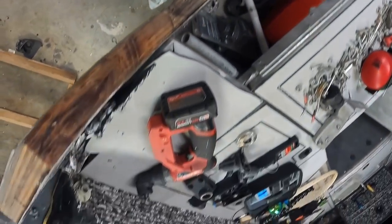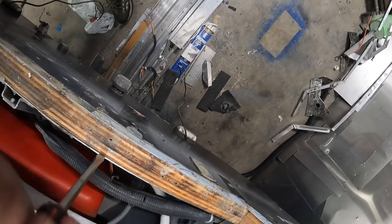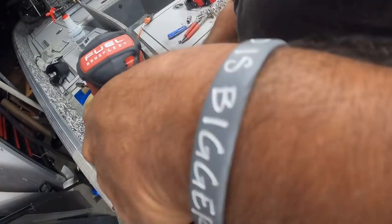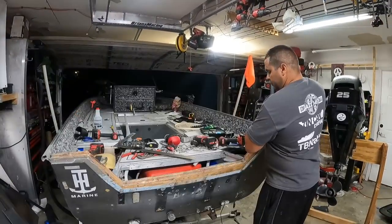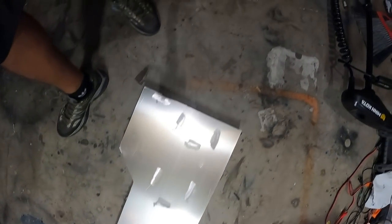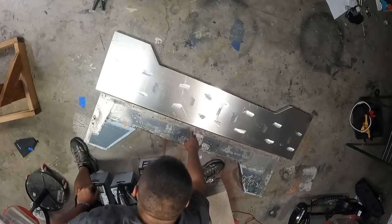Still very nice, still very resin coated — million holes from the screws. Looks like it'll come out. When you're about to pull the transom, you have to go in and pry whatever the transom's stuck and corroded to — the back aluminum plate and the front one. You've got to re-loosen everything, make sure all screws and hardware are out. There could be hidden pins in there jamming it up. I'd recommend screwing into the far left and right and just pulling up with pliers — keep working it until it starts coming out. Now you can use that piece to trace on your brand new transom for a direct fit. Make sure you get the correct overlay because some transoms are thicker and more robust for bigger motors, and some are rated specifically for a 15 to 20 horse. You want to get that direct thickness — you don't want to mismatch.